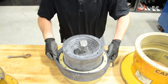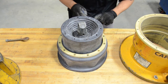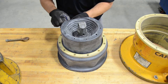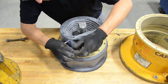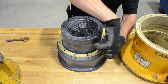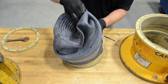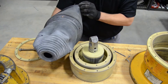We just have to pull down the diaphragm and then there'll be a set of bolts to take out. We've already removed several before the video, but we'll take those out and then the diaphragm will be completely loose. Once the bolts are out, take off the diaphragm holding ring and then the diaphragm itself will just peel up and out. Once it's out, go around all the sides and edges and look for any rips or tears.